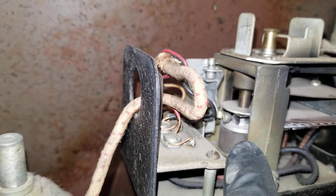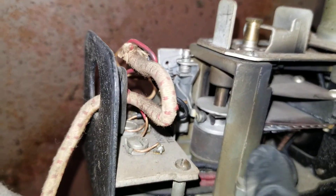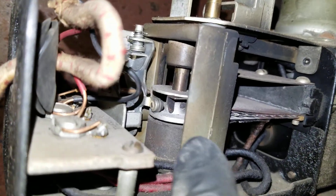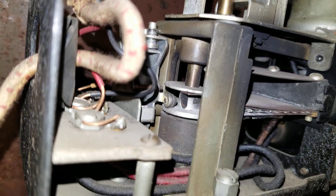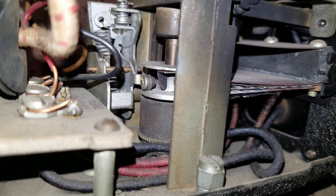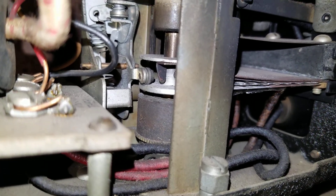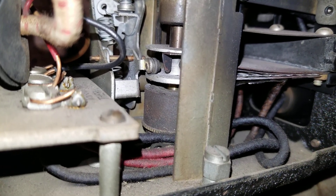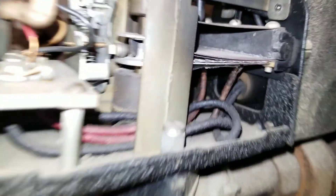Once there is a call for heat, there is a little heater — a 24-volt coil at the bottom right there. That coil has a plunger, and it's opening now. That aluminum piece is actually going up. It's a delayed valve, which means after a few seconds — maybe 10 to 20 seconds — when the heater gets hotter, the plunger will actually pull out that pivot all the way up, and at that point it will be supplying full gas.